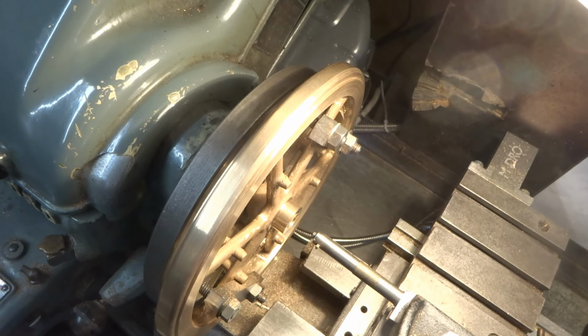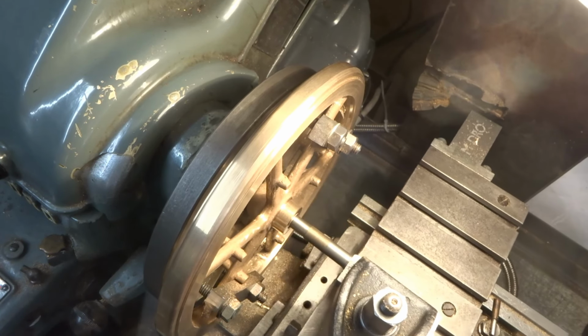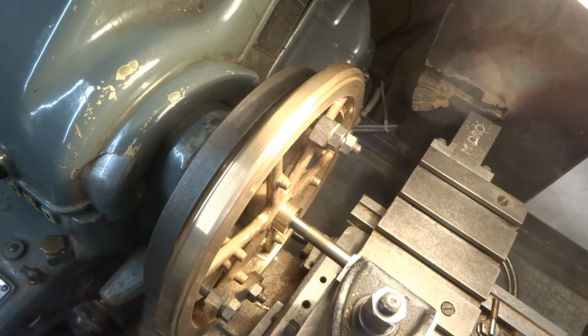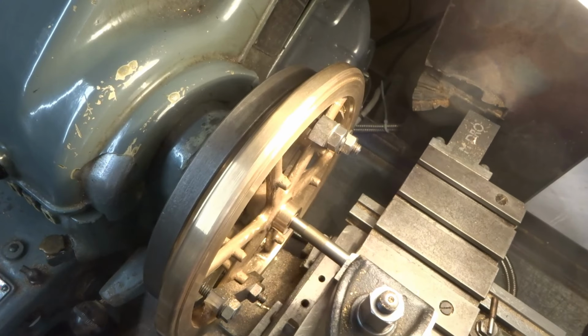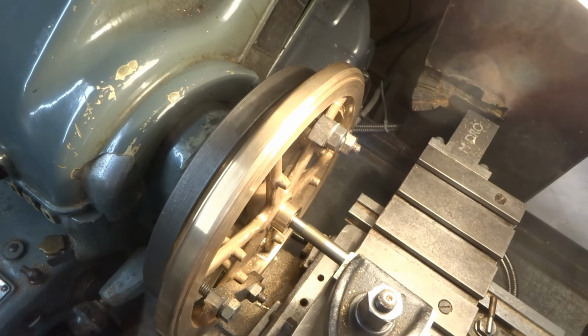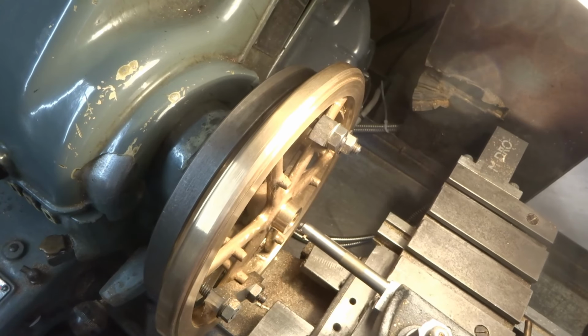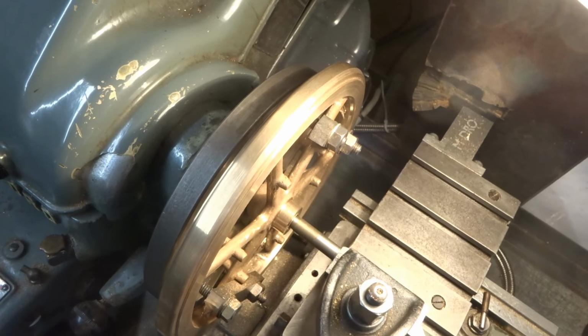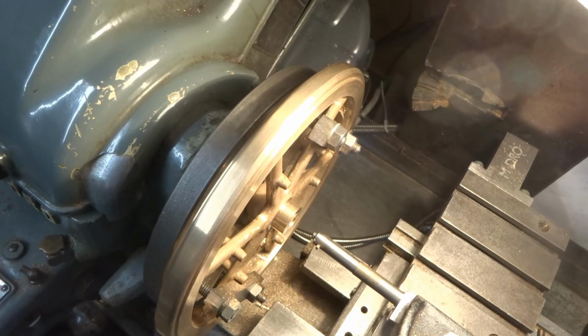This is a rather gash homemade keyway cutting tool, just ground up from a bit of broken twist drill, I think, to be honest. Approximately an eighth wide, slow and steady. Done it before, seems to work alright, especially in brass or bronze, whatever this is.